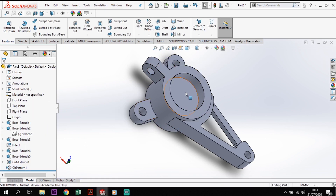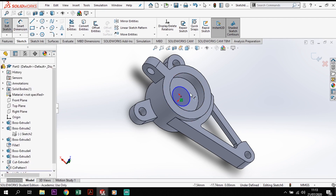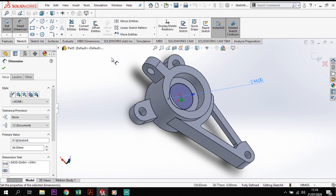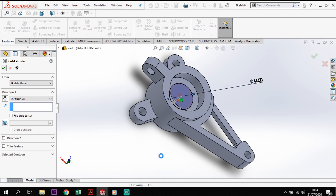For the last part, on the inside surface I'll sketch and drop a final circle onto the origin. I'll add the dimension — 44mm — and cut that all the way through using Through All. Tick, and that is the model completely modeled for the structure.